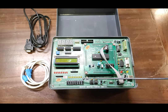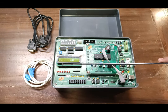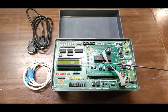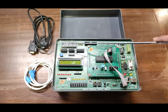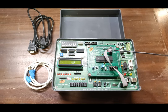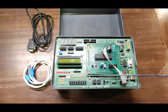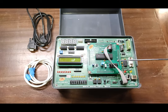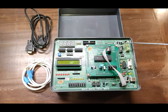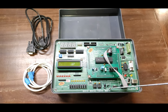8 LED digital input switches provide digital input. A 16x2 alphanumeric LCD backlight display is included. A 12-volt relay and four-digit seven-segment display are provided to demonstrate seven segment operation with the PIC controller. I2C compatible 24C512 EEPROM and DS1307 RTC with battery backup are included, as well as a temperature sensor LM35 and DS18B20 temperature sensor IC.